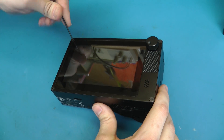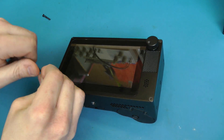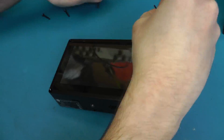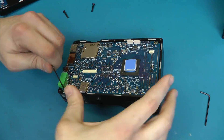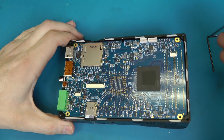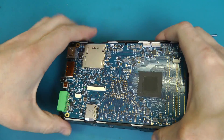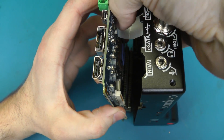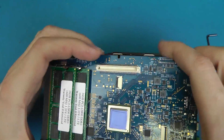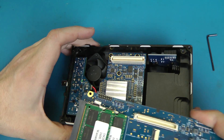Internally, this camera is pretty much identical to the Kronos 1.4. I'll just go over the differences between the two models — I'll skip everything else, so if you want to see the full teardown, check out my original Kronos 1.4 teardown video linked on screen. The biggest change is that the FFC connector connecting to the sensor board has been replaced with a mezzanine connector. On the 1.4 board, there used to be an FFC connector that ran in a U-shape down to the sensor board — that's been replaced with this mezzanine connector, which is much easier for assembly.